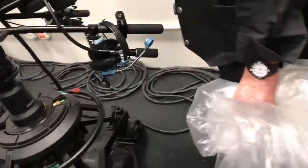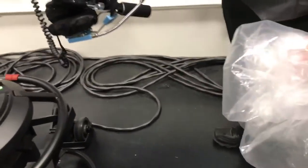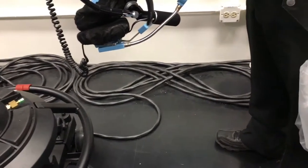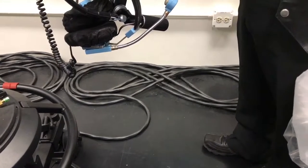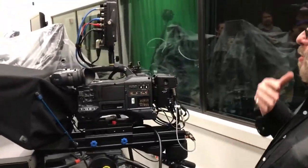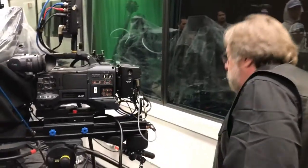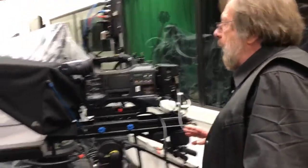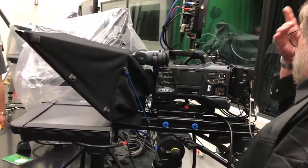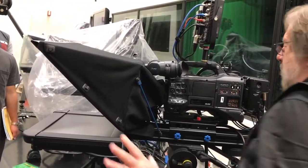You'll notice that these camera cables are always laid out in a figure-eight pattern. So as you're pulling the camera forward, it will come off this bundle of eight straight away — no knots, no nothing. Very clean, very precise. And that's definitely the way you want it to look whenever you're done. Rule of thumb in any studio everywhere: leave it exactly the way you found it. That means clean up all your garbage and make sure everything's back where it ought to be.